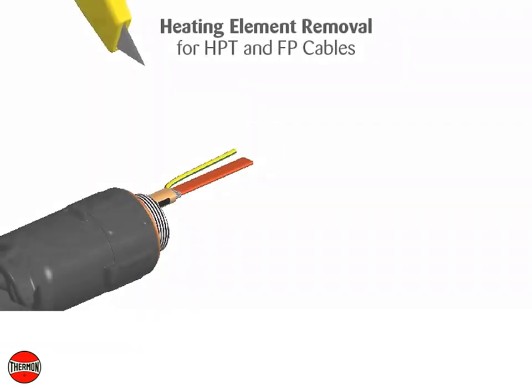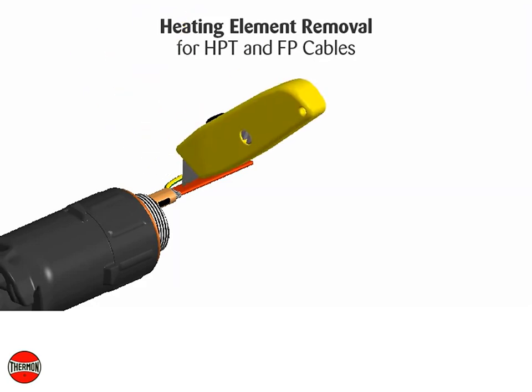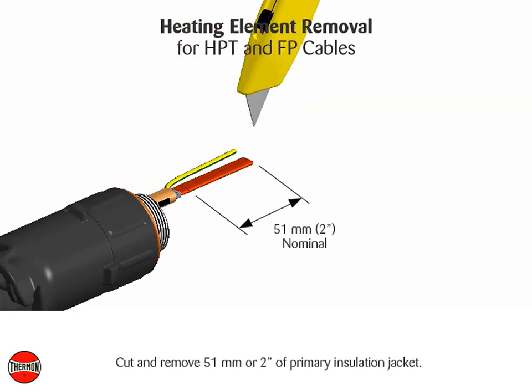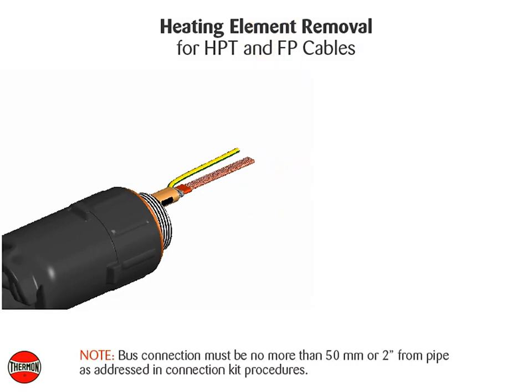Heating element removal for HPT and FP cables. Cut and remove 51 mm or 2 inches of primary insulation jacket. Note: bus connection must be no more than 50 mm or 2 inches from pipe as addressed in connection kit procedures.